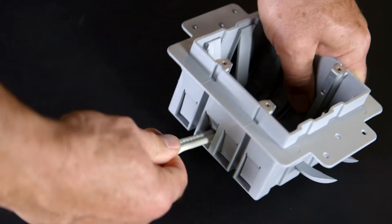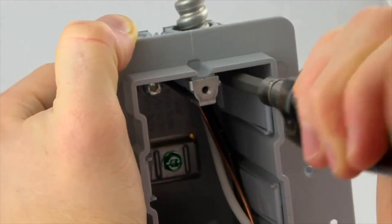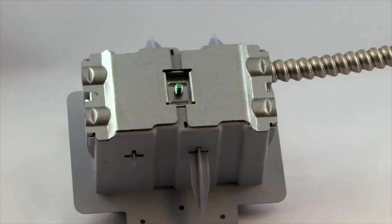The difference between the two Enexo boxes is the type of cable used. The residential box features a push tab connector approved for NMD or Romex cable. The commercial box has a screw down connector approved for use with metal clad, armoured, and NMD cable. The metal back plate ensures proper continuation of the ground path as required by the national code.